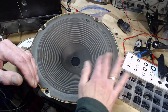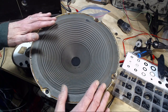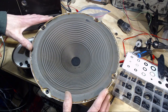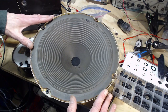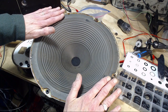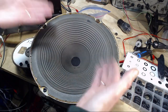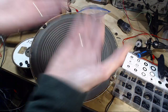At higher frequencies, it's just not that big a deal. But at low frequencies, the bass response of the speaker will apparently disappear. The speaker's still moving, it has to be moving, but you won't hear the bass sound anymore. So the purpose of the speaker cabinet, and the baffle, the term baffle, is to put some kind of plate on here, a big one, so the air has a long way to go before it can sneak around the back. So you could put a large plate on here, a few feet wide, and you start hearing the bass again, because the air wouldn't have time to leak over the edges and cancel itself out. It would get projected again.